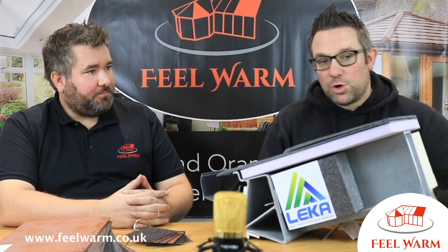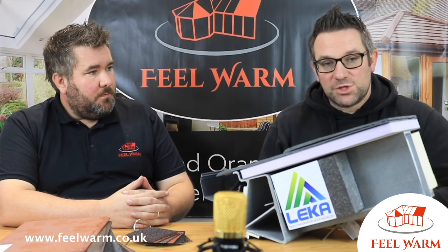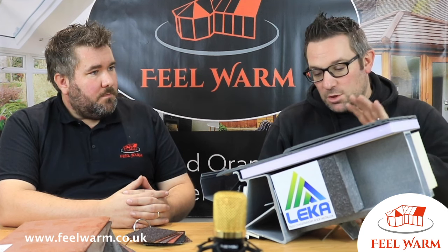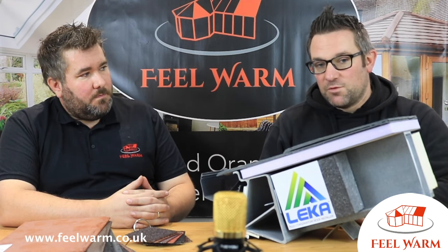You've got a polycarbonate or a glass conservatory. Even with advances in glass technology to this day, you're never going to get a room which holds the heat all year round. So you're only ever going to use it for 6 months of the year when the temperature's mid-range, too hot in the summer and too cold in the winter, and you're firing a load of heat into there to keep it up to temperature, which, with energy bills being what they are, is becoming an even bigger problem. So 150mm of insulation in one of these holds the heat in, reflects the sunlight, and gives noise reduction as well on the top. So it ticks all those boxes.